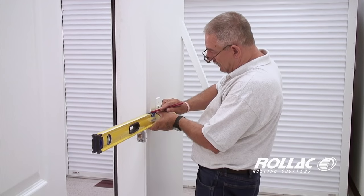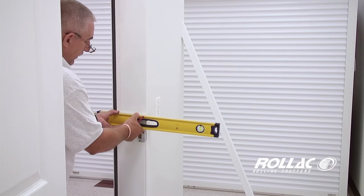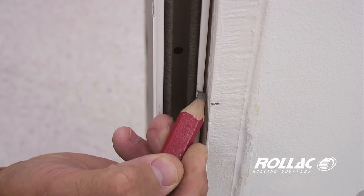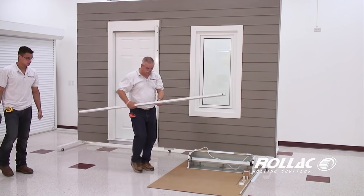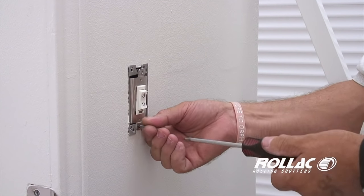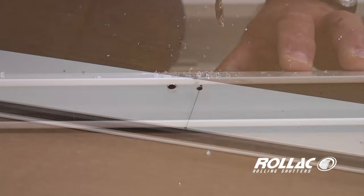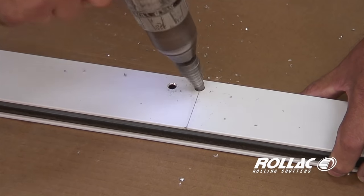This video will demonstrate a wiring application that goes through the wall. Using a level, make small light marks that can be removed and lead around to the point where the hole will be drilled. Remove the rail that will carry the electrical wiring from the motor to the switch. Make a pilot hole with a quarter inch bit. Use a boring bit to widen the hole, making it easier to receive the wiring and to prevent it from being damaged when pulling it through.